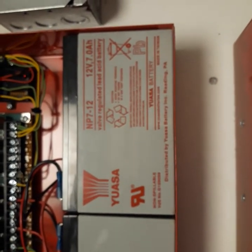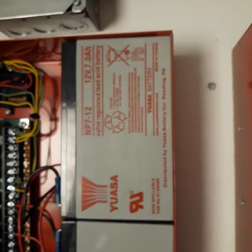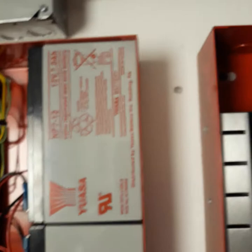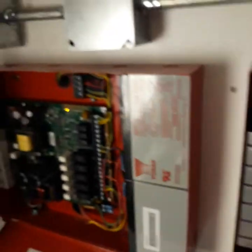There are several things a ground fault can cause: if you get a second ground fault it can cause a short, false alarming, or equipment damage. Also, if it's got two paths to ground, that can bring lightning into the system. So don't just disable it thinking you've gotten rid of it — actually go out there and troubleshoot it and find it.